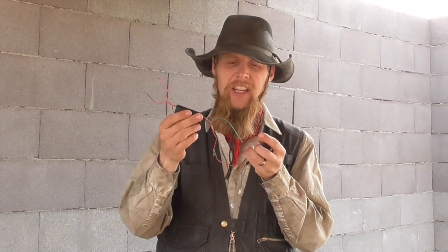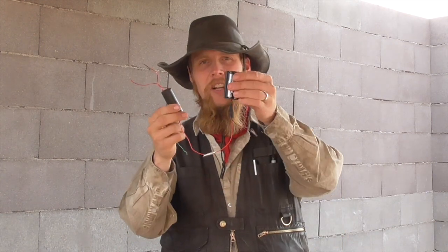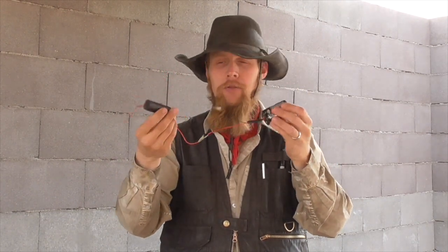So today I wanted to do a little experiment investigating the feasibility of an electronically ignited muzzleloader. I picked up an inexpensive boost converter — it nominally takes four to five volts DC input and the output is several kilovolts, but it still has enough amperage to make a fairly energetic spark. I've got that hooked up to a little battery pack with AA batteries. This could certainly be realistically integrated into a firing circuit for a muzzleloader.